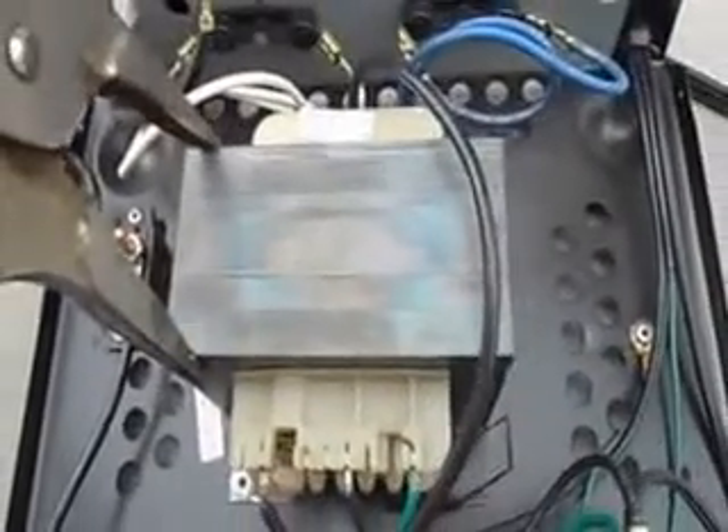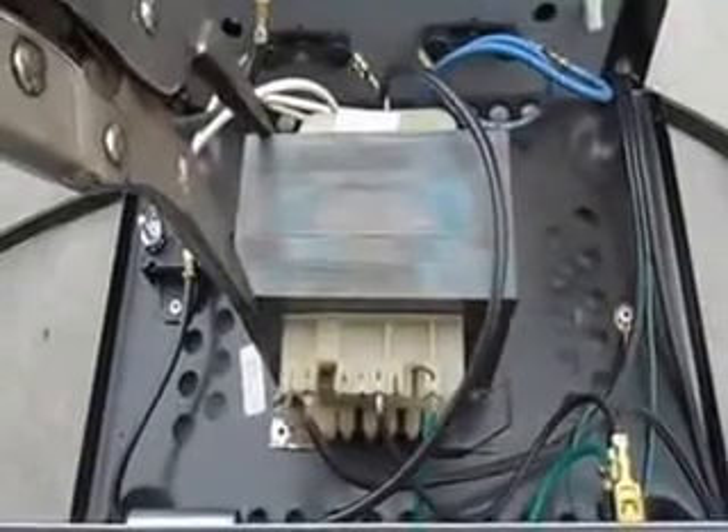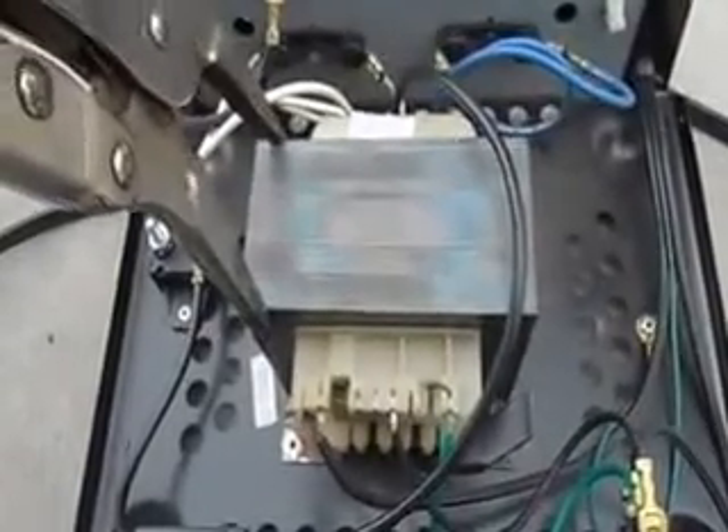They can be quieted down somehow — we'll figure that out. Just to demonstrate, if I put a clamp on there, the transformer quiets down to a very acceptable level. This product is unfortunately made in the United States, and if you examine it closely it's even been welded in two spots on each side, but the plates have still loosened up.